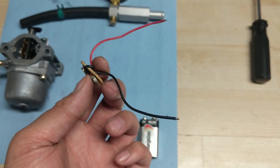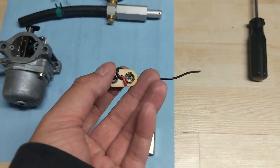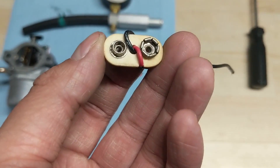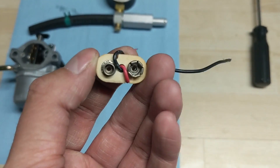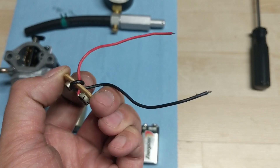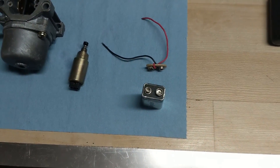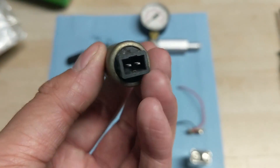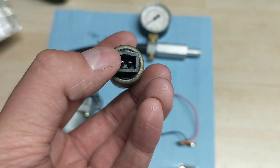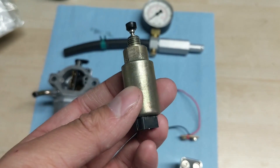The little pro tip I wanted to share is this right here. I pulled this out of a clock — old radios and alarm clocks are perfect because they always have a nine volt backup. All this is is a little nine volt plug connector with two wires, a negative and a positive. I plug it onto my nine volt battery and then use that on two-prong solenoids — negative to one prong and positive to the other.